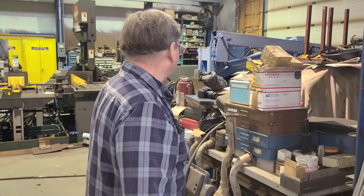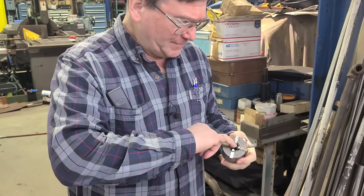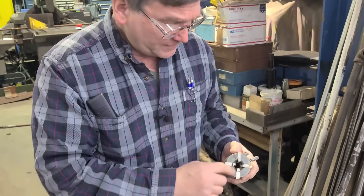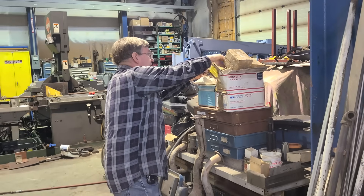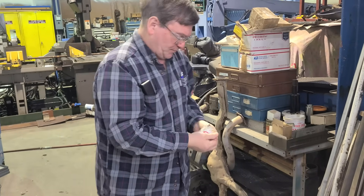So if you're looking for speed, threading chasing heads really speed it up. That's especially true when you're looking at single point by hand, because CNC single point is not too bad, but single point by hand — a chaser really, really beats it. Just like your pipe bolt cutters, they have a cutting edge ground in here, and everything is cutting. There's a chamfer to start, so it starts cutting a little bit easy. Should just pull out a die set.